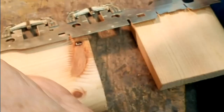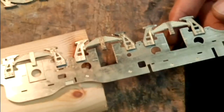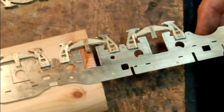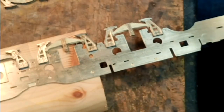Now we've got to solder the other spacers, the rear spacers have to go. David, in the instructions, says you put them in the other side of the frame. This is because of expansion. It's been explained elsewhere, but if you put them all in one side, the heat possibly could expand one frame and you could possibly end up with a twisted frame. So I'll just prepare those.